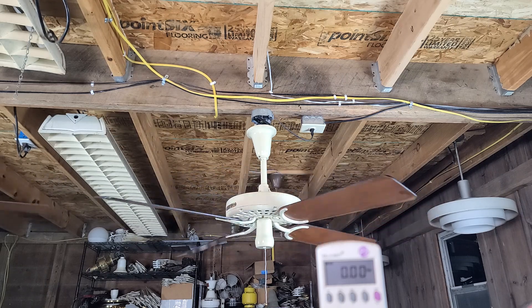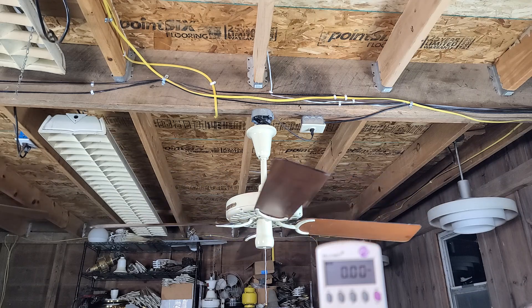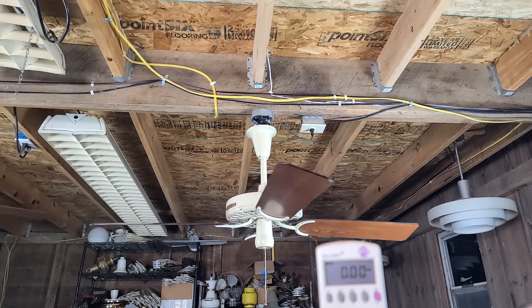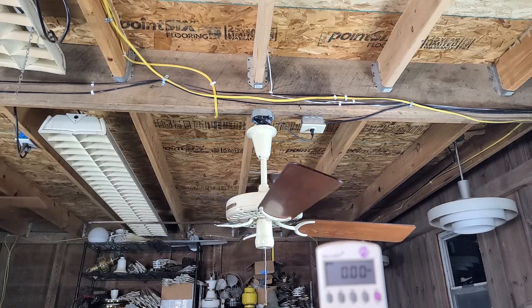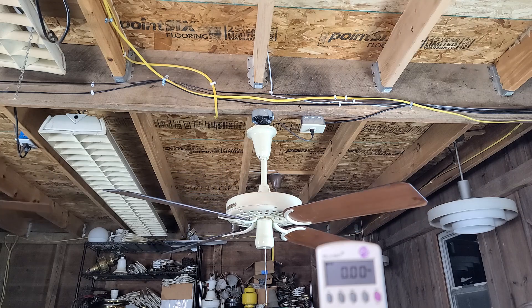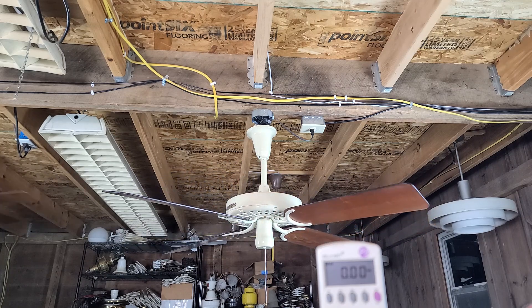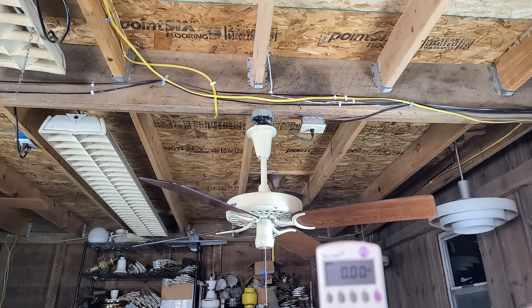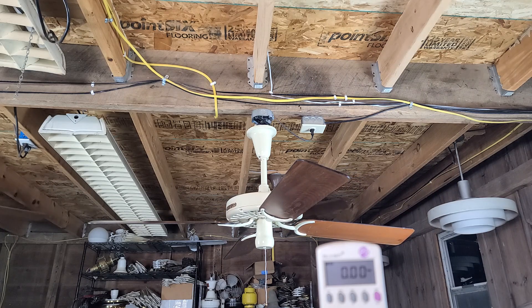Good long spin-down on this one. The oil definitely works through for a little bit. If it's dirty, WD-40; if it's clean, use oil; and if you're not sure or it's somewhere in between, alternate — because WD-40 is going to eat through whatever existing crud, metal shavings, or chemicals are left. But then if you just put oil in there it won't get everywhere it needs to go if there are still blockages. That's why alternating works well — just running WD-40 since it's a fresh restoration.